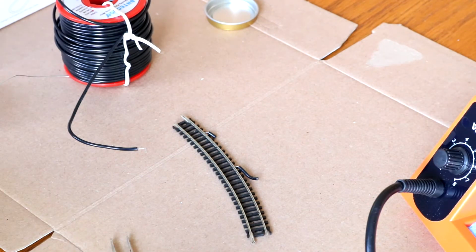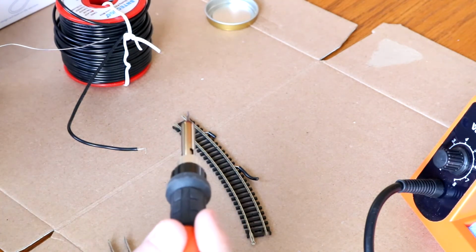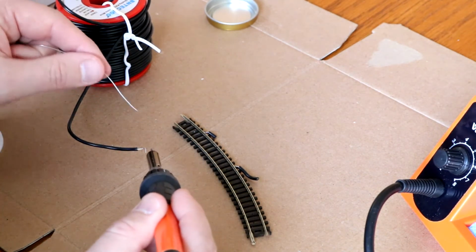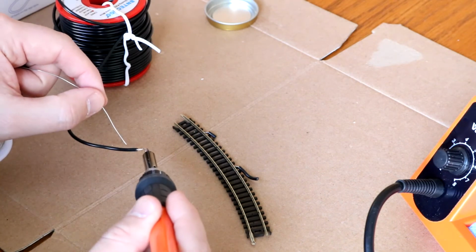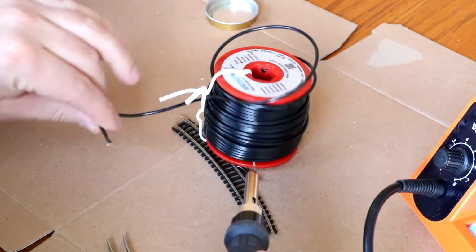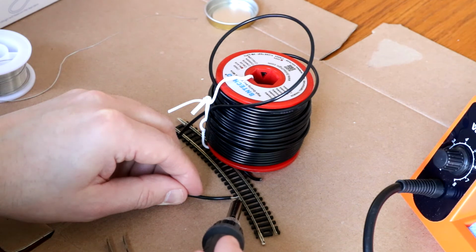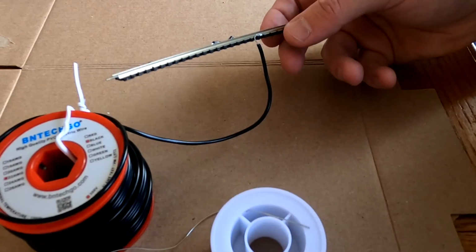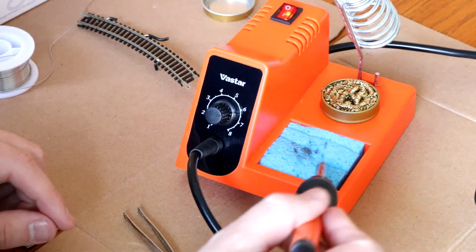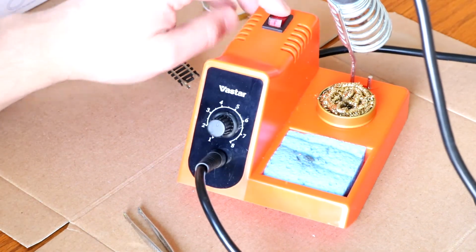So on this occasion, I'm going to go ahead and tin the wire, even though this is supposed to be pre-tinned, I'm going to tin it anyways. I think it'll help the flow quite a bit. Far better result on that third one. Obviously, after we've used it, we want to clean our tip. Put that in there, and we'll shut it off.